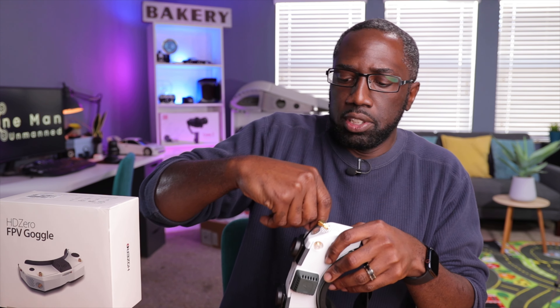Now repeating the process for the Tiny Hawk 3, which has the smaller Whoop Light VTX. Delete the previous VTX file, paste the Whoop Light VTX firmware to the SD card root, put it back in the goggles, scroll to Firmware, select Update VTX — success, very quickly. Plugging a battery into the Tiny Hawk to check results. The font on the OSD has been updated and looks amazing — a more modern font. Both our goggles and drones are now fully updated.